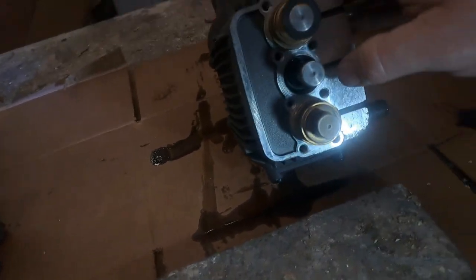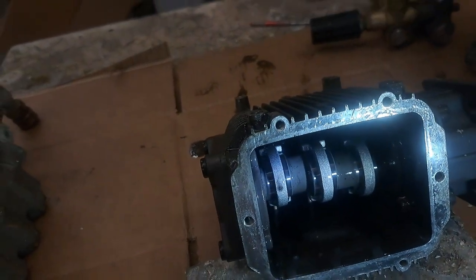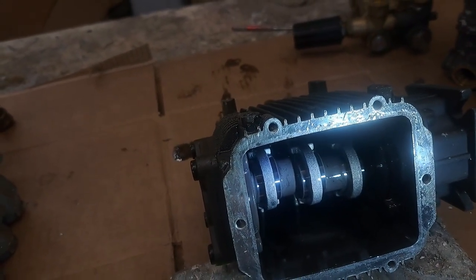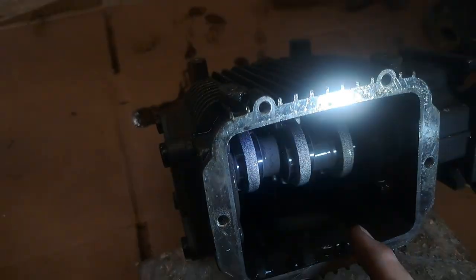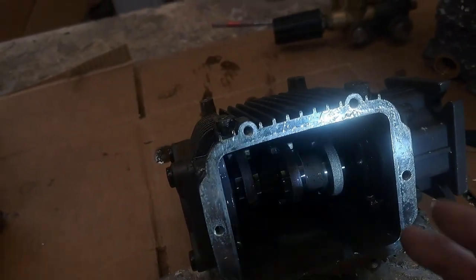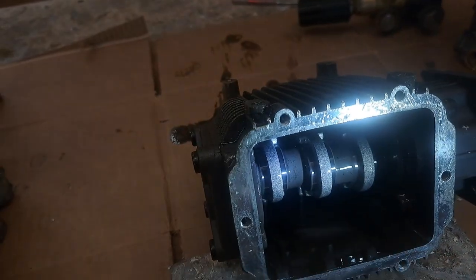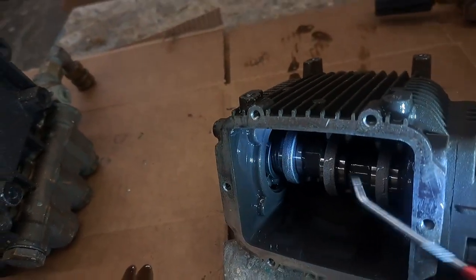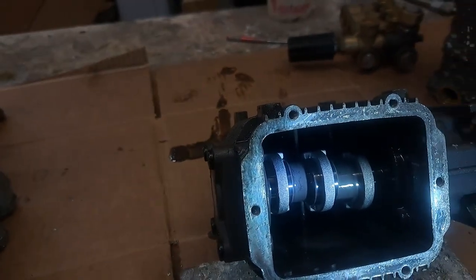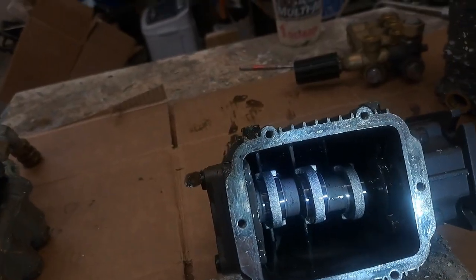The head is separate from the crank. There are oil seals down in here that prevent water from getting into the crank and prevent oil from getting into your water. If you ever have water in there, you have a bad oil seal — kind of like a blown head gasket on an engine. Water mixes with the crank and oil, damages your bearings, damages everything. When that occurs I always suggest replacing the pump, because by the time you buy the parts you could have bought a new pump and a half.